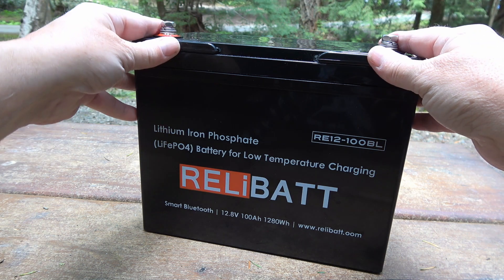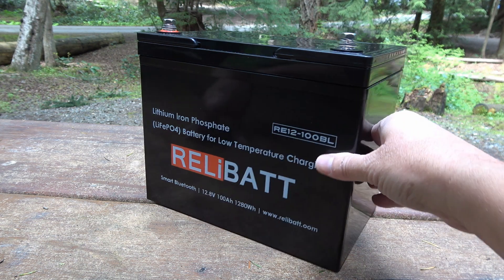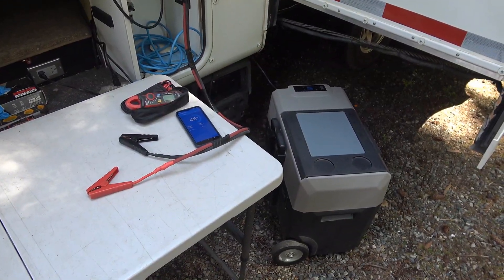I'm going to take this battery and drop it in my portable freezer, which can go down to minus 4 Celsius, and let it sit overnight. Then I'll pull it out and hook it up to a charger and we'll see how it performs. Reading the manual, it says the heater pads should draw about 4 amps and warm up the battery to the point that it can switch on charging. Also, maybe I'll do a discharge test — it's supposed to discharge at about 100 amps. Let's test the main feature of this battery: the internal heating capability.